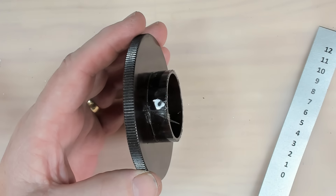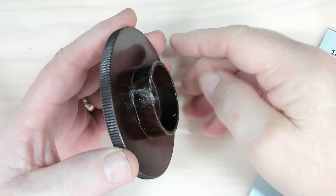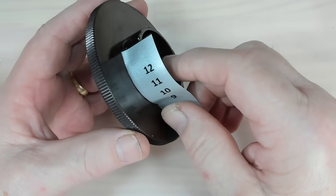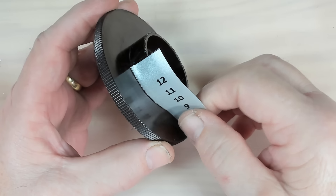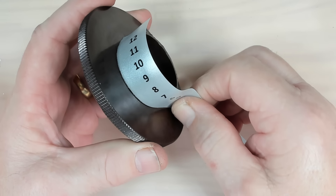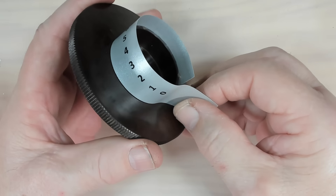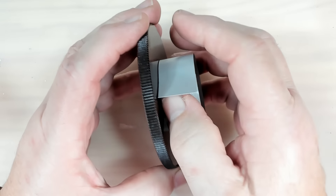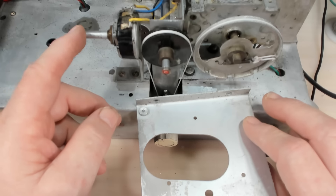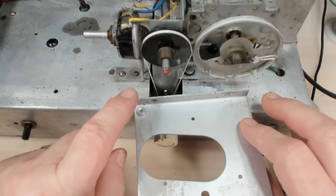I've printed a new scale. There's a little scratch mark I've put in there — that's where the black line started on the old scale that was on there before. I'm going to wrap that around there. I've put some thin double-sided tape here so hopefully it'll just stick. I've left a little tag there so I can get the protective cover off. My scratch mark is there so I'll line that up and wind it around — that looks pretty good. I'll just trim that off.